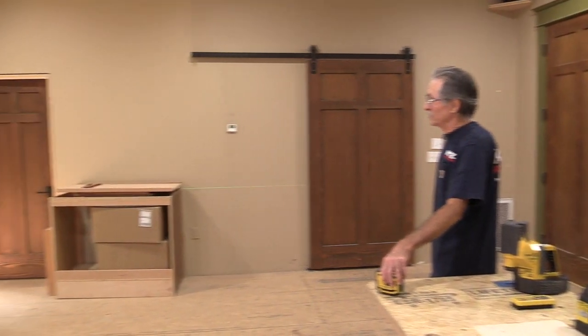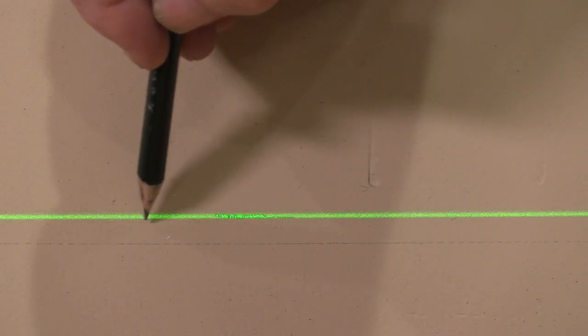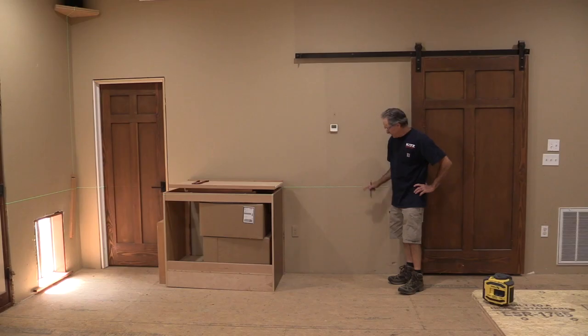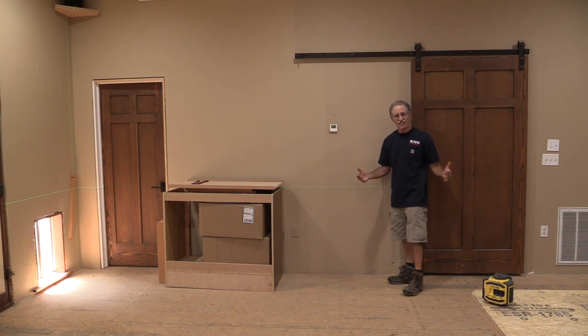Then I'm going to come back to the laser and rotate it again, this time putting it in the far corner, swung past the center, and I'll put another pencil line right next to that first one. These lines are within a thirty-second of an inch of each other. If you look at this really closely, this laser is so accurate over 30 feet that it's almost zero deviation. Over 50 feet maybe it's off a sixteenth, at most an eighth of an inch — which means no problem on apartment buildings, tracked homes, or any short-distance layout. You can definitely rely on that laser.